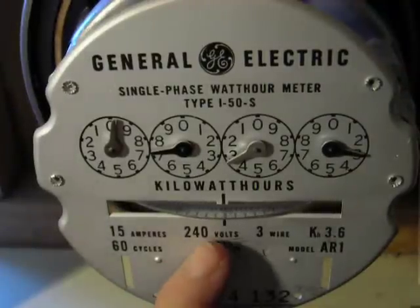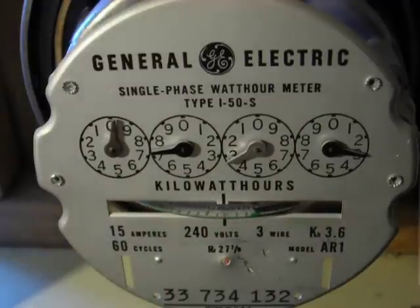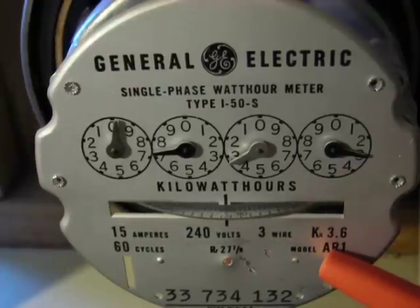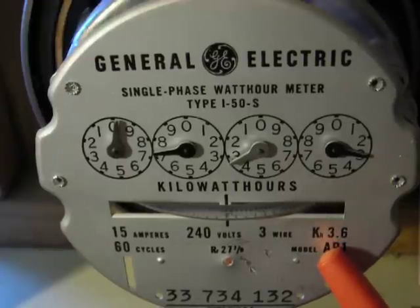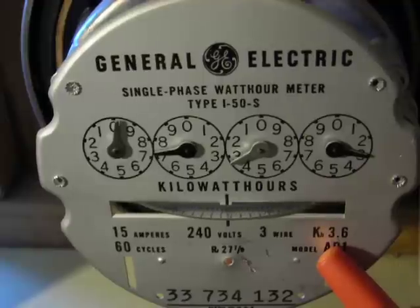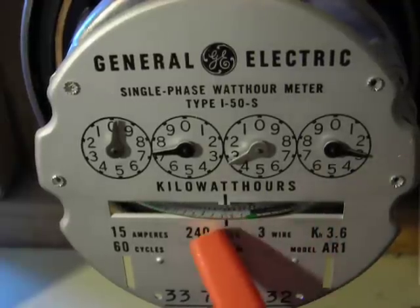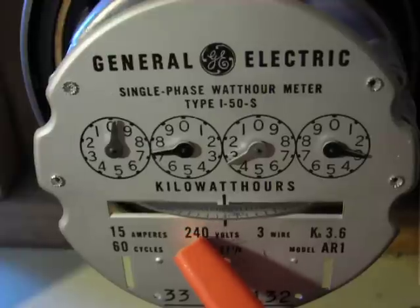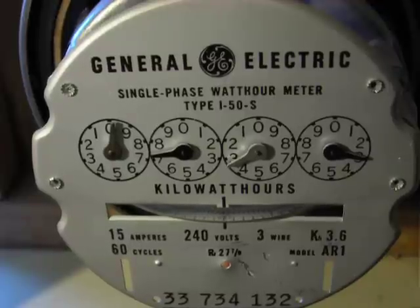Anyways, this disc in here, if you just take your meter, a common one today, a newer meter than this, it's what they call a class 200 meter, generally a Kh of 7.2, so the meter constant's higher. Anyways, you take this number, multiply by 3600, and that's the number of watt seconds for 1 rev. You can put that number on a label, you just count the number of seconds this dial revolves, and divide that into the number you calculated, and that's the number of watts. It's fairly accurate. I mean, these things are accurate generally within a few percent or even less.